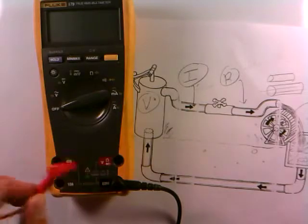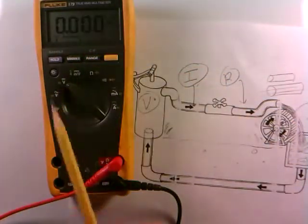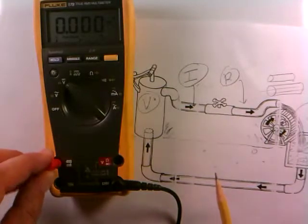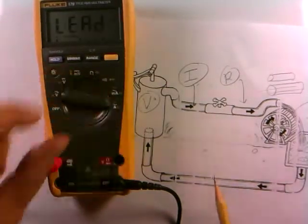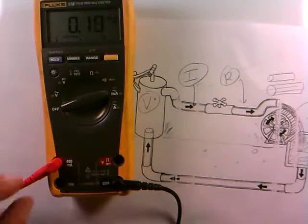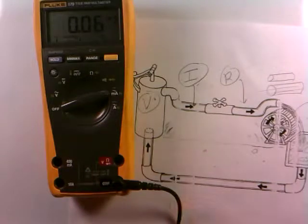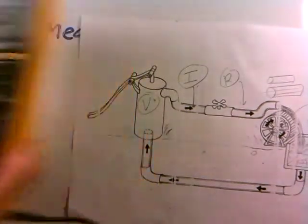When you're in voltage mode, you'll always want to click your meter to a voltage setting, and if you go to current, you'll want to click your meter to a current setting. The meter doesn't automatically adapt for you — voltage and current measurements are different, and you have to get your meter ready for what you want to measure. That's why there are different jacks and different settings.